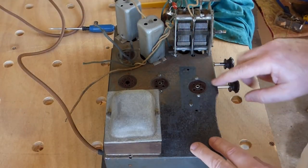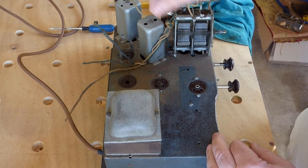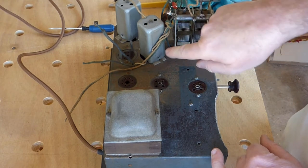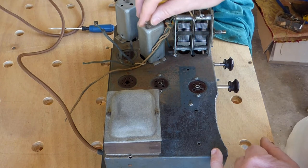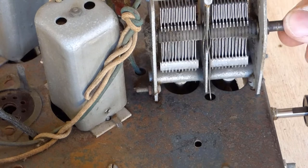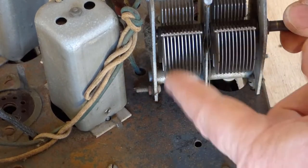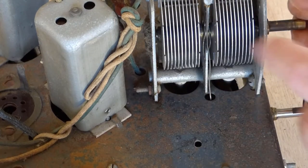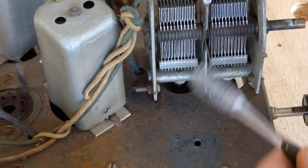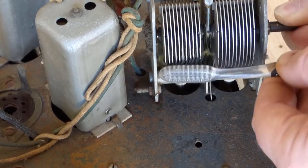Just get all this surface rust off, then we'll treat it and coat it. I do need to remove this can to get that wire out and replace it, but I shouldn't have to bend these tabs up — I should be able to just undo the two nuts on the bottom side and this one on the top, then lift it up once I've disconnected the grid cap lead. Now there's something worth mentioning while I'm cleaning in here: if you've got crackling while you're tuning, that can often be caused by dust or debris in between the plates of your tuning gang. The rotor or the stator both get filled with dust over time, so what you really want to do is get in there and get all the dust and debris out. This one is nice and dry and the little fur balls have been quite easy to just wipe out.